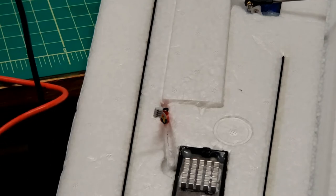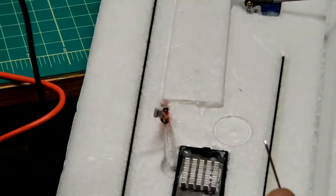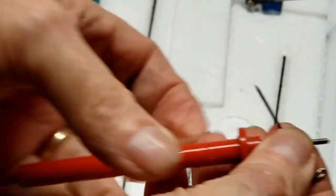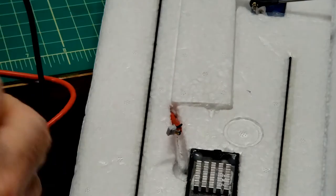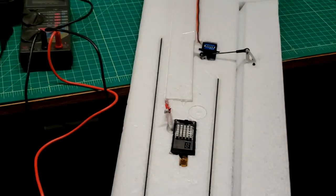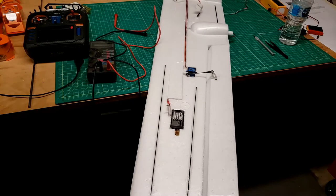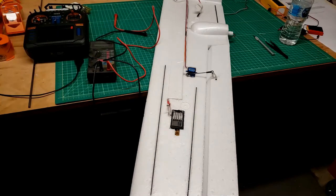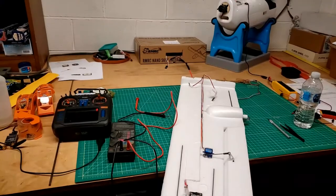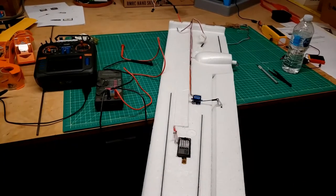Anyway, like I say, I had to use a push pin. This is just a push pin like you'd push into a bulletin board or something, but it gives me a sharp enough tip to hold like that against the meter lead and put in this connector. All of these wires were 100% fine. I really didn't have to disconnect it or anything. I guess my problem up there with the one pin in that four position connector isn't such a problem as I was worried it was. So I think it's now down to board voltage, perhaps, or this transmitter could be completely blown all to pieces right there.